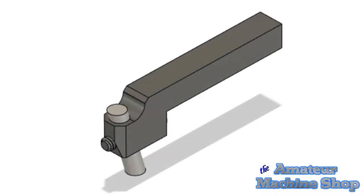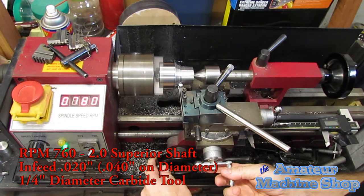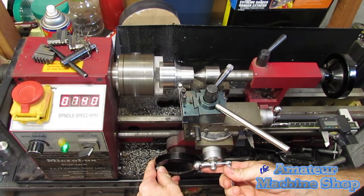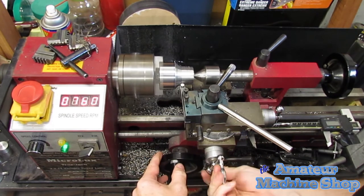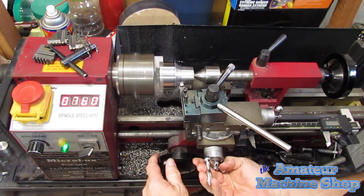The last tool bit holder is the 1/4 inch carbide shank holder. I tried all sorts of things, light feed, various RPMs, but nothing took away the vibrations. The amount of radii on the bit that cuts the steel is too large for such a small lathe. This tool would be reserved for aluminum and when I need a large radii on a part.